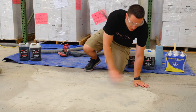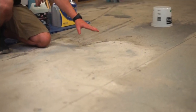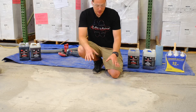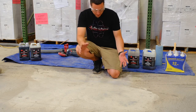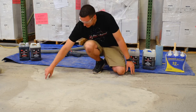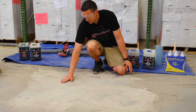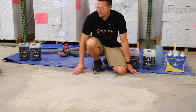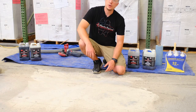Over here where we kind of grout coated it, you don't have to get through everything — you just need to make sure it's flush and fully abraded. If you grind too deep into the floor, especially if it's pitted, now you're going to have a belly in the floor and you don't want that. Here where we shot blasted, you'll see a little bit of the gray line — that's where the patch is, and it's flush with the concrete. It just stays filled in. So then we're going to vacuum the concrete and then move on to our epoxy coat.